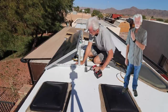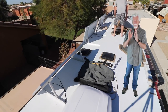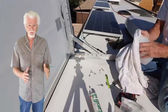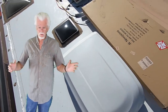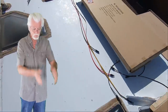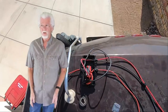As we moved along we got the first two panels in. As I showed you in the spreadsheet, we hooked them up in series and we'll join up with panels three and four going back towards the rear, also hooked up in series. Each panel is 210 watts, so two of them in series makes a string of 420 watts. We have two strings of 420 watts, and then we join them together in parallel down in the combiner box at the end. So we've got one solar array going down the driver's side with 840 watts of solar.